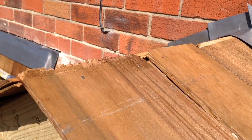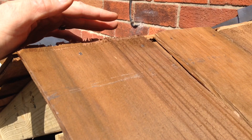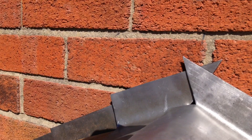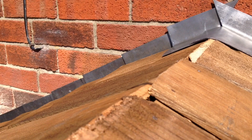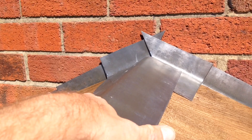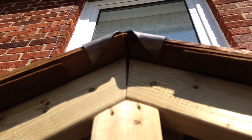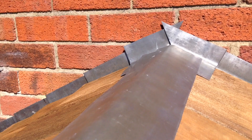I've fitted cedar shingles to both sides of the roof now and where I got to the top I just cut them off level with the apex. Now I'm at the lead work on the apex — to be honest I'm just making it up as I go along. I've got some lead cut out, another section which is going to overlap, and I'm going to fix these two into position with a single nail. Then I've made another section of lead to go on top of the apex — I've cut a kind of snake tongue shape into it so it can be positioned here and the lead can be folded around the shingles. I'm going to be making ridge tiles out of cedar shingles to fit on top of all this lead work to keep it hidden from view.